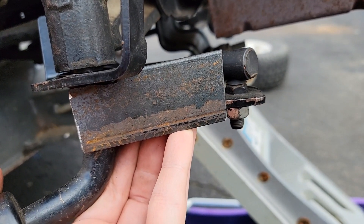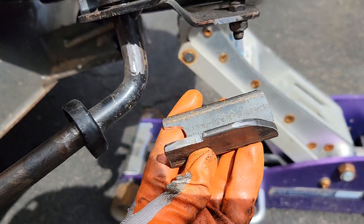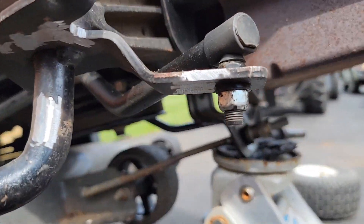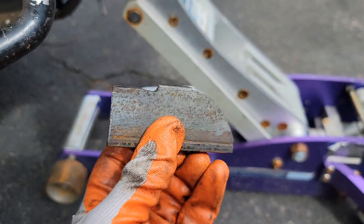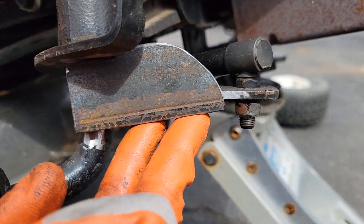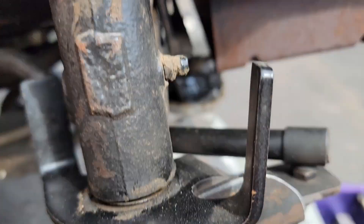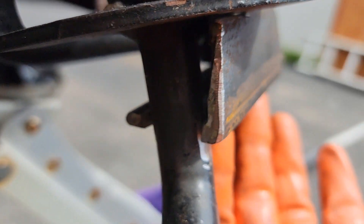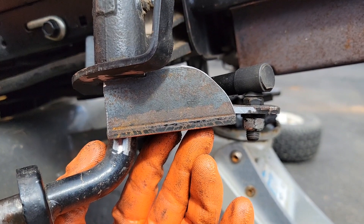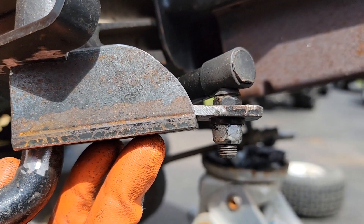I'm going to grind a little bit just to make it look a little better, then I'll come back when I'm ready to weld. This is what my final plate looks like — the only necessary feature is this notch right here that fits over top of there. I went ahead and ground to fresh metal everywhere I'll be welding, and put a nice curve on it so it sits up and looks more planned without that sharp edge. I'll weld there, underneath, right there on both sides where it goes onto the axle. One thing to look out for: make sure you have sufficient gap so you can still get a socket over that nut.